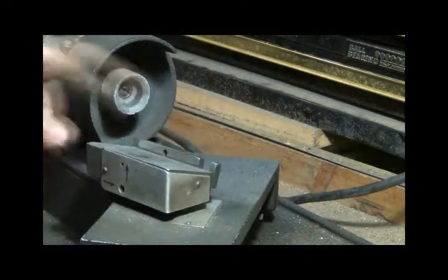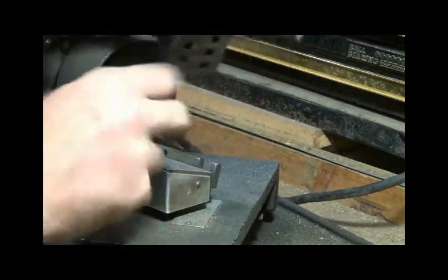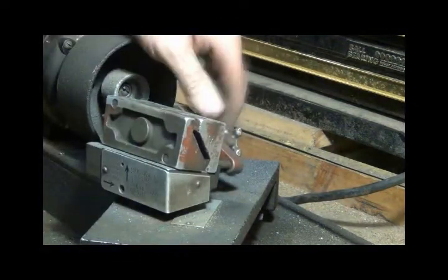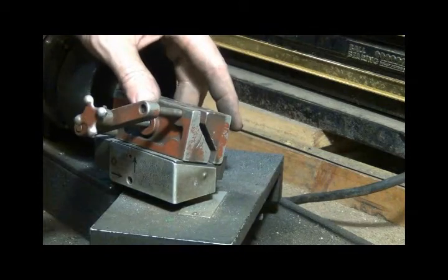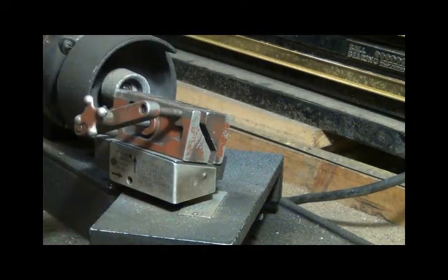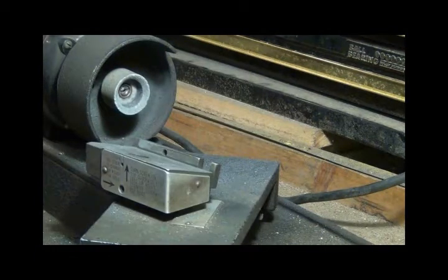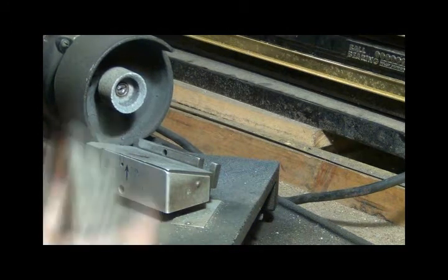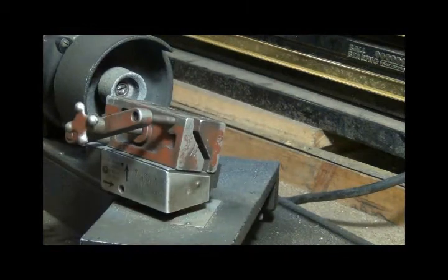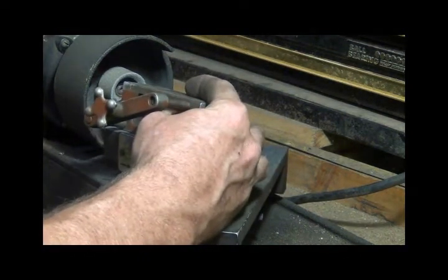And there's a roll pin here that you slide the front of this up against. And there's a notch here for this when you got it this way. Then you flip it over and it'll push it up against that roll pin again. And that keeps you the same distance from that cutting wheel. Okay, you got a knob down here that you can screw in, and that runs that motor back and forth. So you set your drill bit in the frame there, and I come in here, turn the motor on,